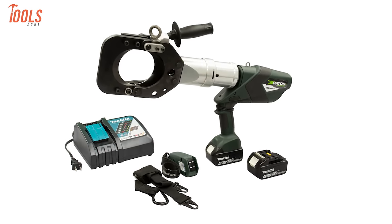Struggling to prep bonded medium-voltage cable screens by hand? Speed up insulation removal with Insto's ST308 professional-grade stripping tool. Its adjustable peel depth and ball bearing rollers now effortlessly strip jackets from 18 to 60mm cores without risk of conductor damage — no frustratingly slow manual picking or inconsistent razor nicks. Its calibrated depth settings strip away screens cleanly in precise 0.1mm increments, leaving smooth, even underlays ready for stress-free termination. With an integrated stopper to prevent overrunning and low friction operation requiring no added lubrication, reliable harm-free prep work is ensured.